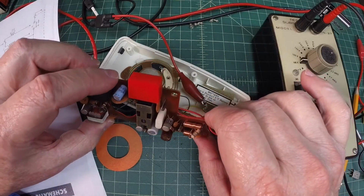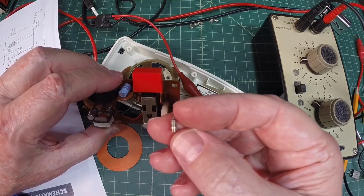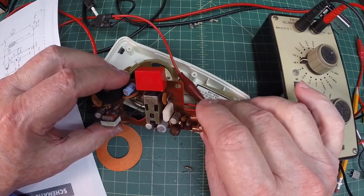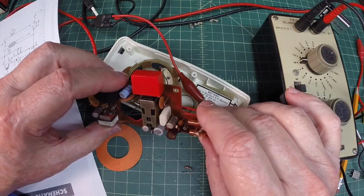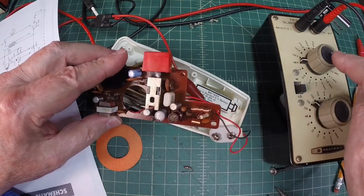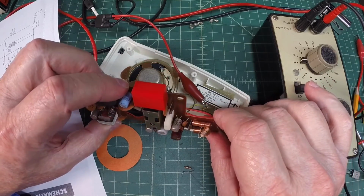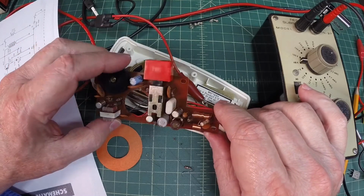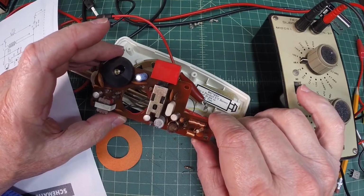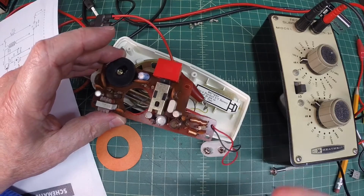Okay guys, I think those were quarter watt resistors, and I had a big 1 watt 150, but I had a 180 that looks like it's about a half a watt. That puts it right at 20%. Tested that to make sure the oscillator works with that resistor value. It does, so that's good enough for me. I'll make a note of that just in case I have a problem in the future. But let me get the battery back in here, and we'll test it again.